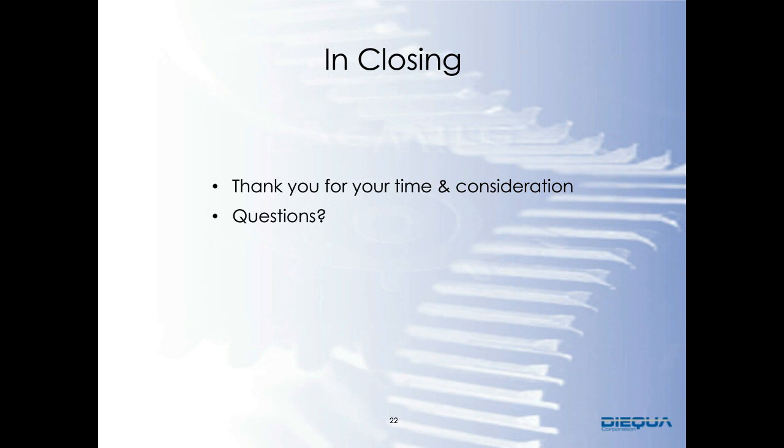I mentioned efficiencies in lower speed type applications or applications that have frequent stops and starts. In lower speed applications where we're causing the motor to start and stop, because it's sliding friction that we're overcoming, we need to take into consideration the no-load starting torque and the capacity of the motor. So whether it's a gearing technology from DieQua that would be a planetary solution, a helical bevel, spiral bevel type gearing, we'll look at what the ratio is, the amount of torque, the degree of customization, and we'll work very closely with the customer in consulting with the best solution for the application.